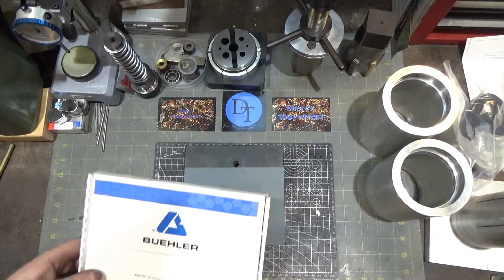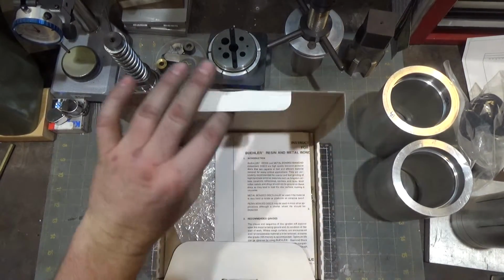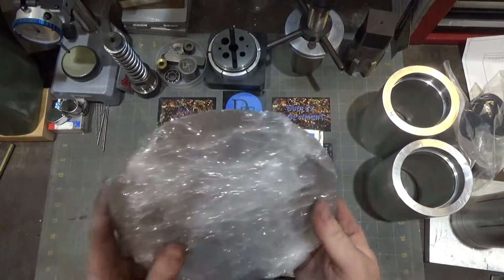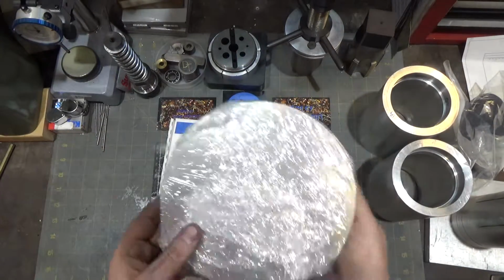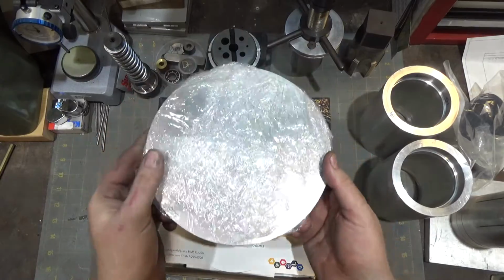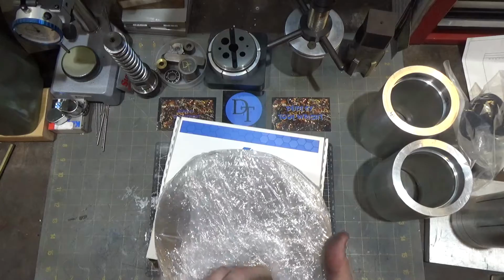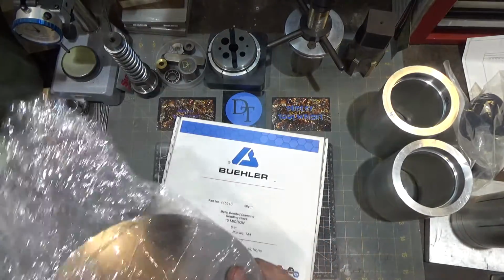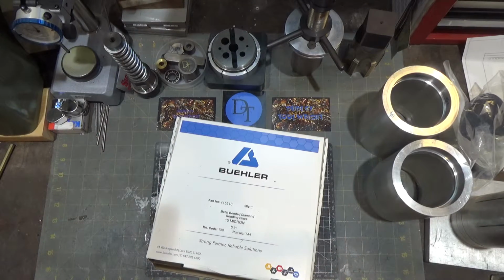Continuing along this idea is this. I found this on eBay. This is a 15 micron, and this is a diamond bonded to metal. Lapping stone, and pretty handy. It's designed to work on a magnetic wheel, but I can use it lying flat on a surface just as easily, and use this to grind down carbide or anything else that needs a flat surface so that you don't end up with out of round or out of square shapes.